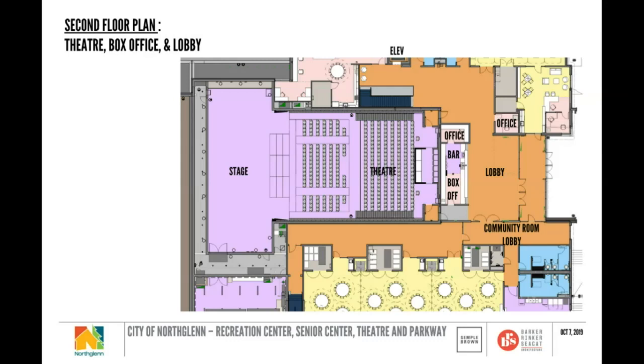Those are the seats that are more steeply raked for an accentuated sight line. And then at the same floor level as the lower floor and the stage is where we have our cross aisle, which features a fair proportion of our accessible seating. So we'll have accessible seating both at the top and at the cross aisle. And then the two aisles leading forward toward the stage are our accessible path to reach the musician's pit for musical performances. So I'm highlighting the ADA provisions because they're working in several different ways for us.